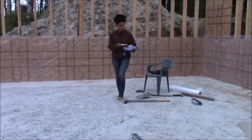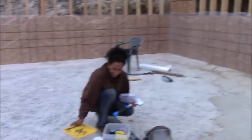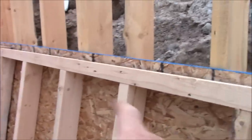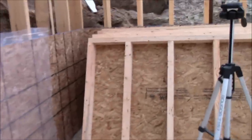So here's what we've got going so far. We've got this panel built — one, two, three, four, five, six — seven built today. That's what we got. Now the rest are going to be short ones. We're going to staple all the plastic on here tomorrow and we're going to go around the outside tomorrow and just put pieces in here so it doesn't give way. I think that's pretty sturdy, but I don't want to take a chance on the corners — I'm just going to put a piece of two by four in the corner so it doesn't pop out.